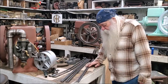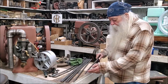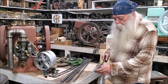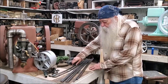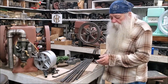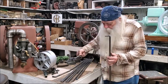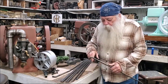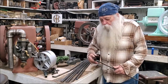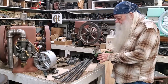Now the next operation is to bend that 1-inch bend, and then bend there about 9 inches up this way, and then bend the other handle in a 1-inch inside bend, and all of them come out true and perpendicular. The thinking was to overbend this handle end a little bit so you can align the handle to the angle of the brackets and how wide they are apart. Then you can put this onto the anvil. A couple of hits with the hammer will spring that upward or downward as needed. Back to regular programming now.